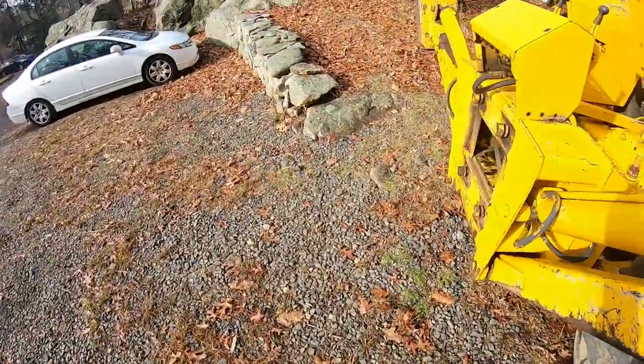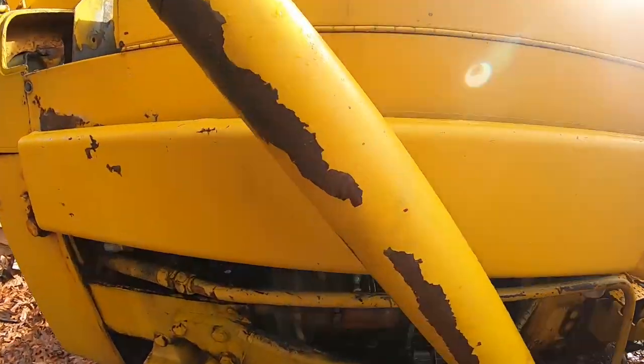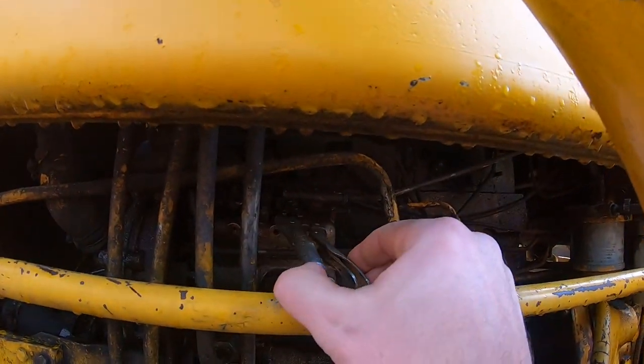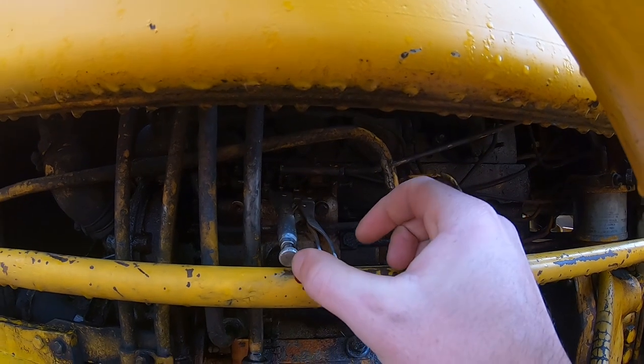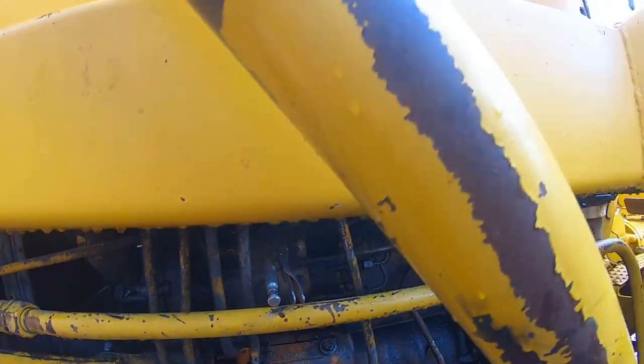So what they ended up doing was they just put a vice grip on the pump down here. So it's right there, and essentially they just set it in the right spot to hit the stop up there, and it just acts as like a cam to give it enough throttle to actually do something. So they got it down the road and on the trailer doing that, right?